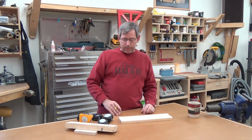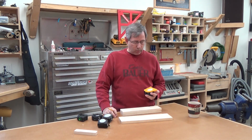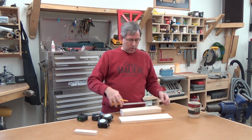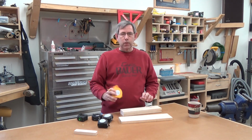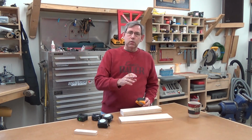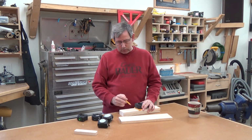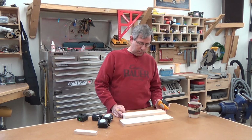They have a tape here that's called the squaring tape for framing carpenters. And this is pretty neat. If you're a framer, first thing you do, you make your measurement. Say we got 8 inches there. Then you put your tape away, you pull out your framing square, you put a 90-degree mark across the board so you can cut it. Well, this has the square built in, so you just lay it up there and make your mark.